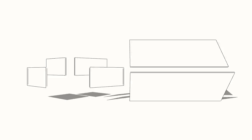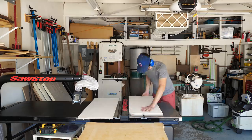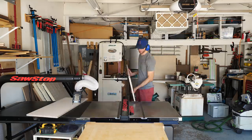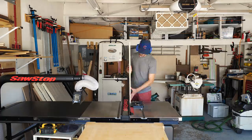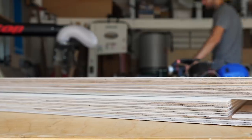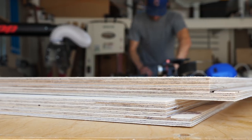So far I've been breaking down my plywood into their rough dimensions, which you can see right here. Once that was done, I could use my table saw to cut a series of rabbets in the two side pieces. This is pretty straightforward, just making a pair of cuts along each edge to clear out the material. But for the top and bottom pieces, which are really big, I couldn't do it on my table saw, so I decided to use my router instead.